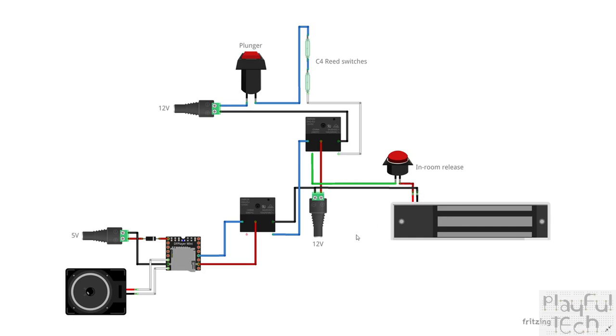When the plunger circuit is complete and the primary relay activates, it breaks the normally closed connection and switches across to pin 87 — the blue wire. This energizes the secondary relay: power comes in on that side and the relay closes pin 30 to pin 87, which shorts two pins on the DFPlayer Mini. This is the trigger for the DFPlayer to play the first audio file saved on the SD card, sending audio out through the speaker.